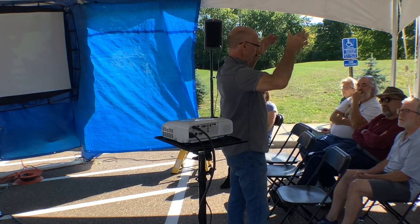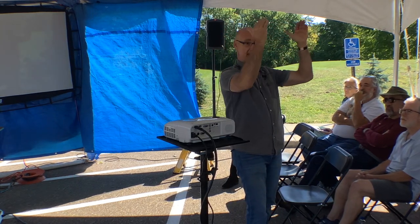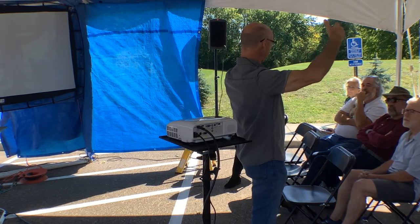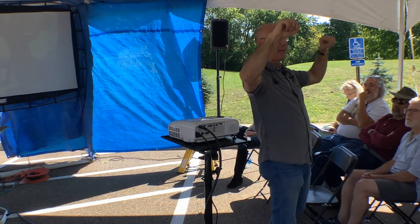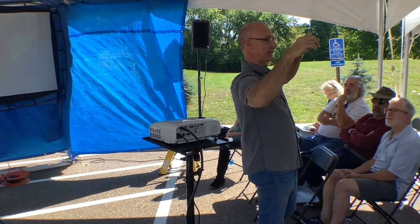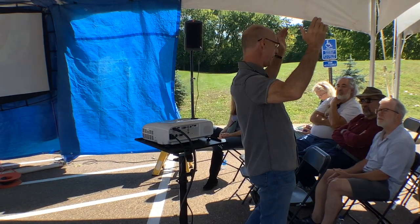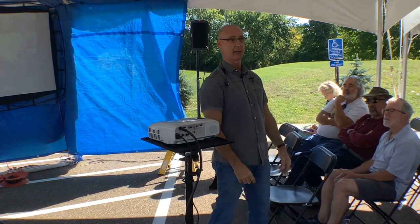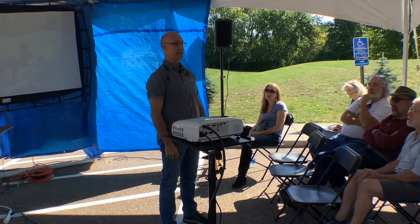So what the space balls do is they prevent the panel from rattling when it's at its smallest, but they are foam, so they still allow it to expand when it's humid out. I'd have to go back and look. I think I'm making the panel like 3/16 smaller than the frame. You gotta look at the space balls, don't hold me to that number. But you undersize the panel before you raise it so that when you put it in the frame, it'll accommodate the space taken up by those space balls. Don't skimp on the space balls.